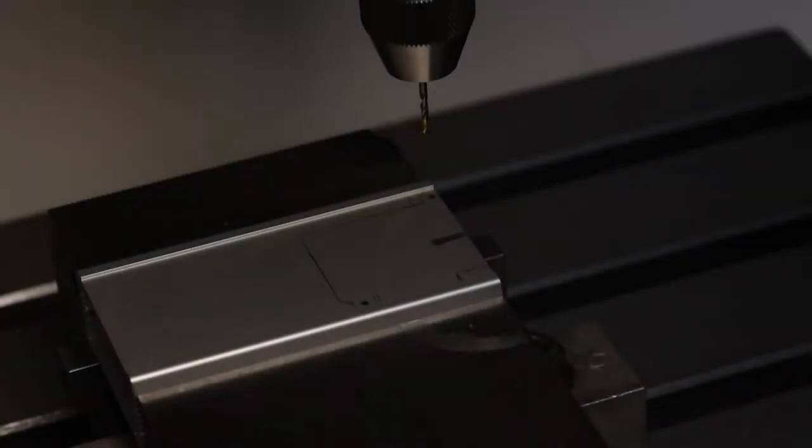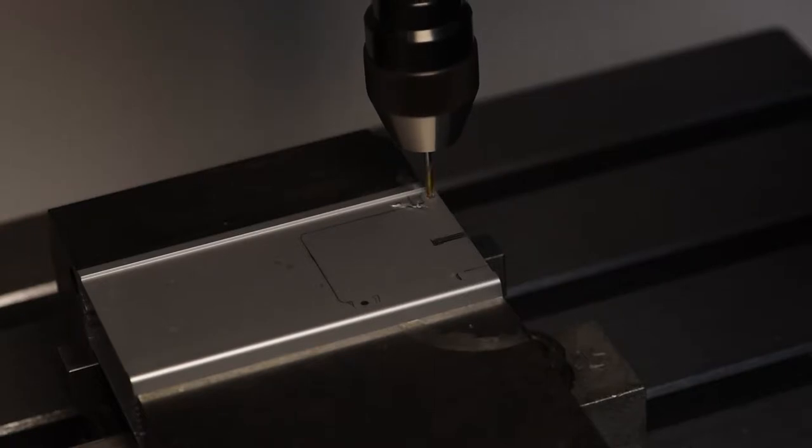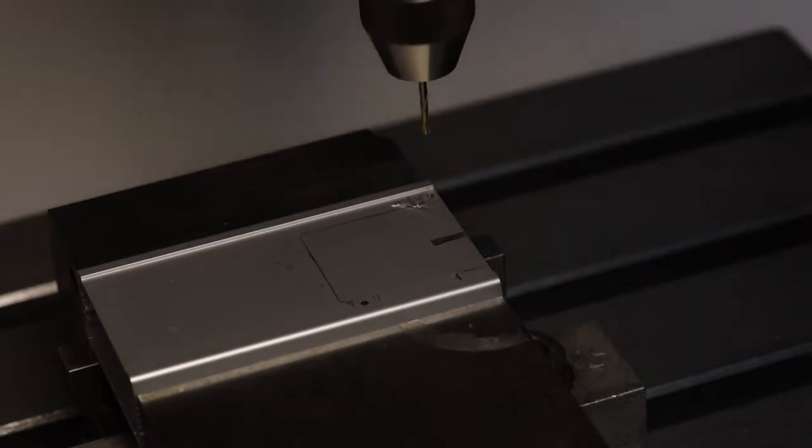Moving on with these markings to the milling table, you can see the aluminium body is attached into place with a drill hovering above it, and with this drill we are now going to drill away the holes for the screw attachment of the pyboard. It's best to know the approximate diameter which you will need, because this will of course dictate the diameter of your drill head. It's done on both sides.